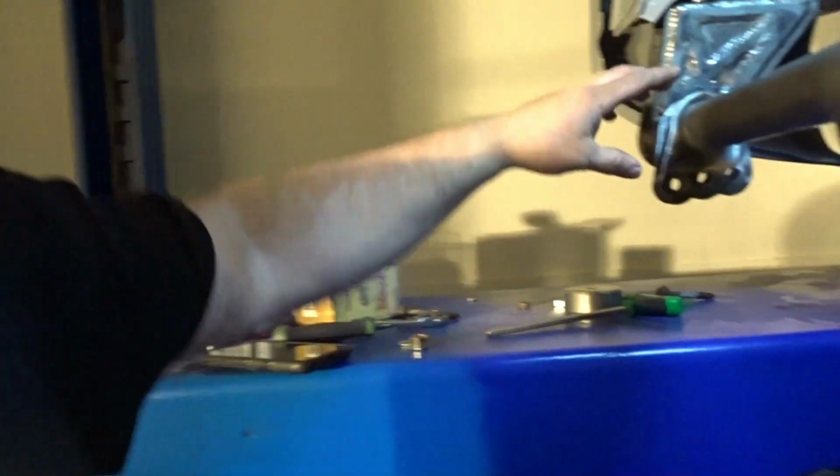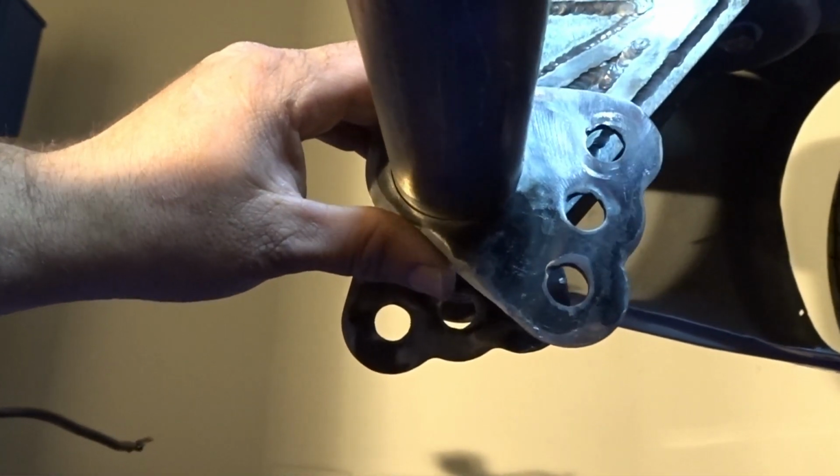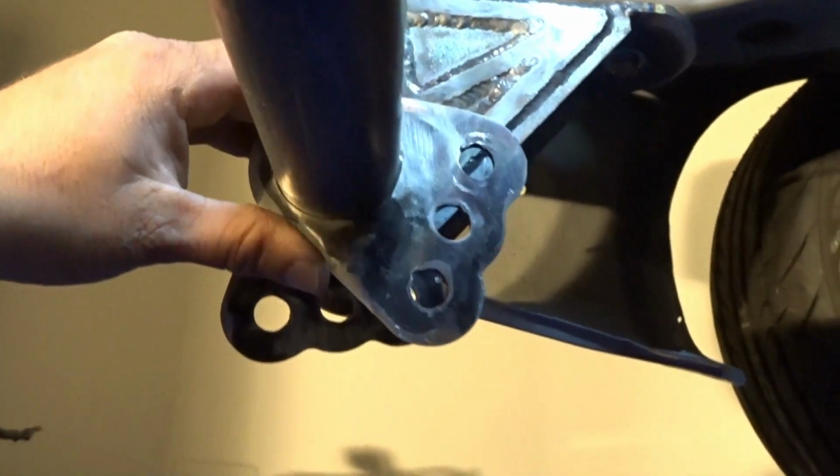The other thing to have is adjustability. If you see my brackets, there are 3 positions, low, medium, high. They are also not straight. These are on an arc of the length of the bar. So if you wanted to change position at the track, all you have to do is pull the bolt out, slide it up, and you have a new position. So the next thing is length of the bar.